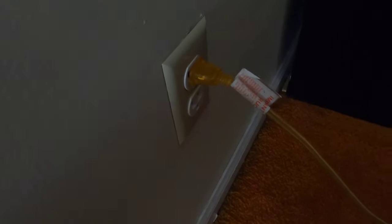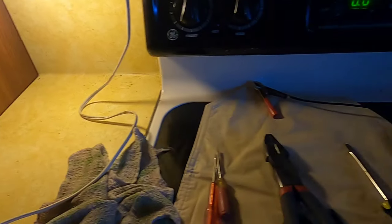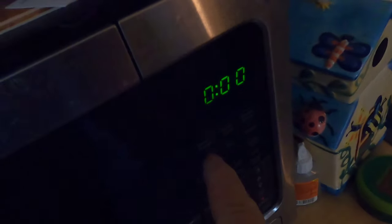I changed this outlet. I didn't change the other ones because I picked up the wrong color, but I changed the faulty outlet and threw the circuit breaker. This one works — this is the one that was working to begin with, but it also feeds the other lines and wasn't feeding them before. Let's go check inside. This is where the coffee pot goes — that outlet's working. This is where the toaster goes — that outlet's working. And the microwave is working. So we're good.